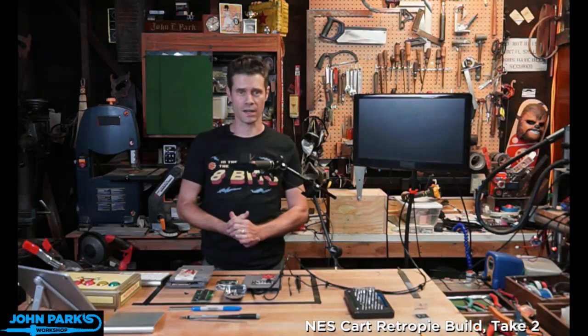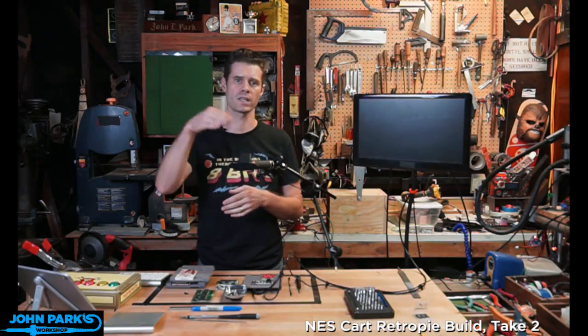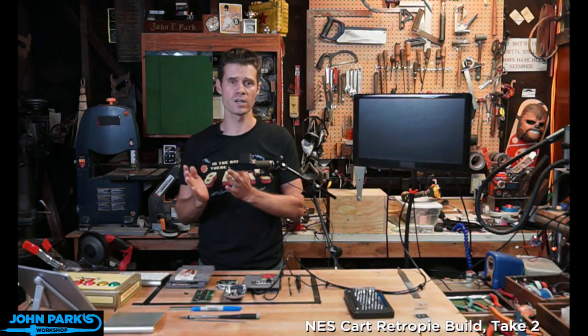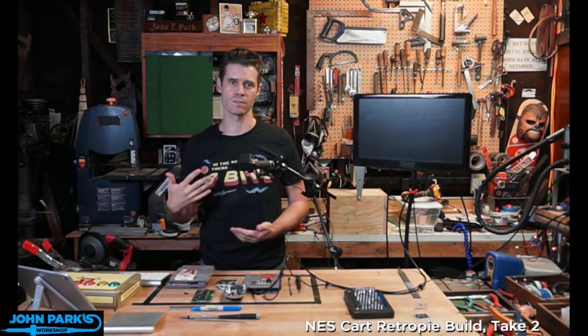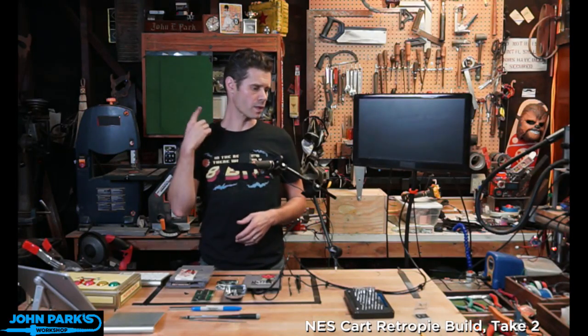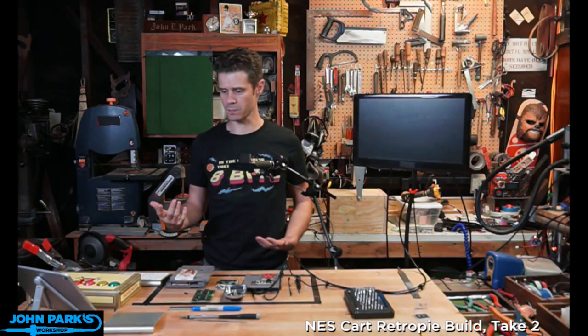The overheating device I think I fixed as well, cross fingers. I have a capture card that is for HDMI to USB, and it was like 140 degrees on the surface of the case. It's a little aluminum case, so I went ahead and opened the case up so it at least can let some heat out. There was no vent on the thing. It had a heat sink on the chip, but the whole interior of the thing was baking hot. So that's one part of it. Second part of it is that I now have AC running in my shop, and so ambient temperature is a heck of a lot cooler. So that's hopefully a recipe for everything working.